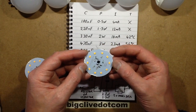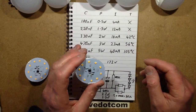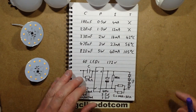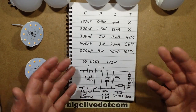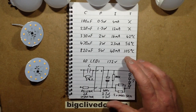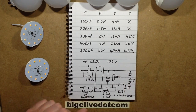Although it looks like just 10 LEDs, it's actually 10 LEDs with 6 chips each, so there's a total of 60 LEDs in there. The combined forward voltage was tested at 172 volts, but you'd expect roughly about 3 volts per LED, so somewhere in the region of 180 volts. That works out to about 18 volts across each individual LED package.